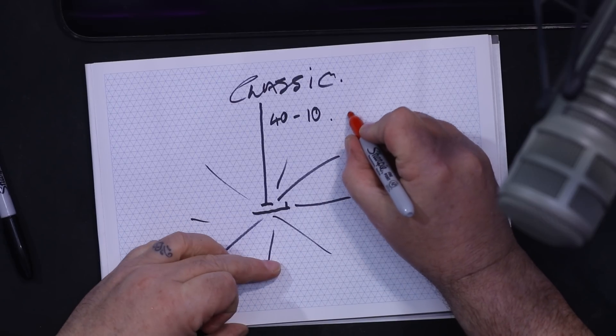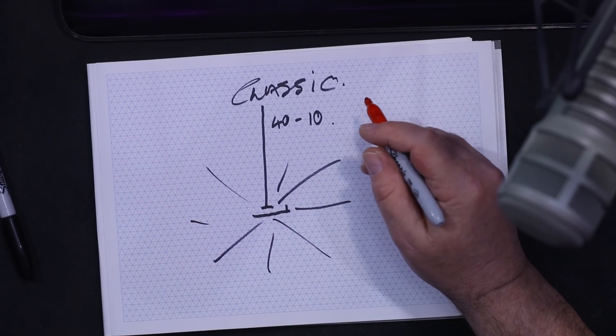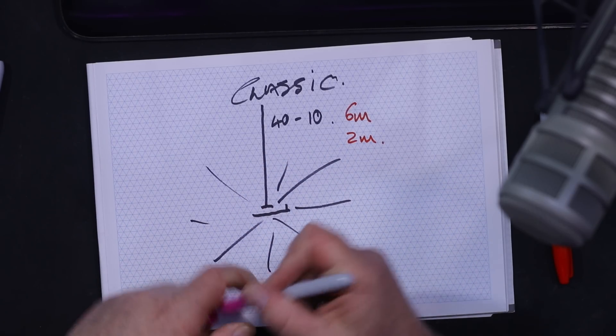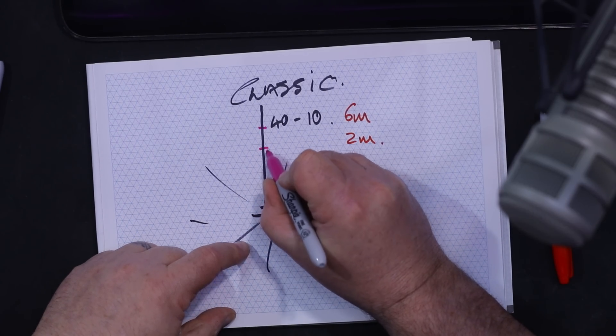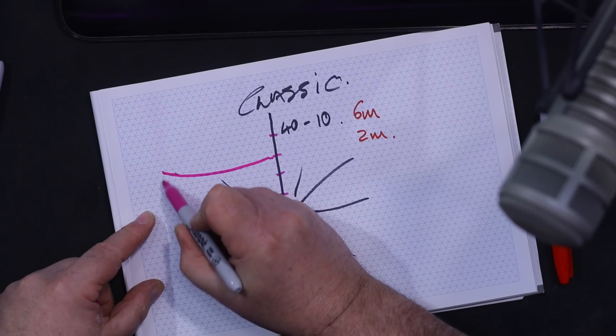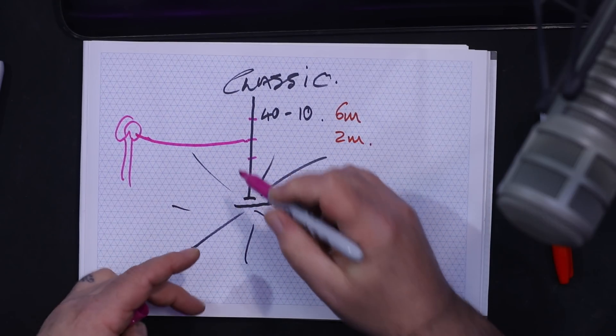In that configuration, you'll get pretty good — better than 1.5:1 — tune on the SSB portion of the 6 meter band, and a couple of people on YouTube have even opened repeaters on 2 meters with this. So it's 40 and up. There are a number of plates used on all these models: an upper spreader, a top spreader, mid spreader, and a guy plate. What I discovered on holiday is if I took the 30 meter element and ran it up and along about halfway up to a tree, you can get an inverted-L on 80.